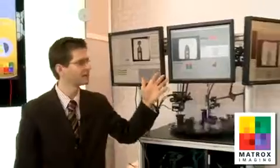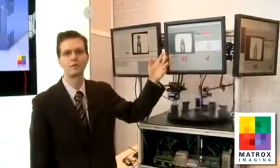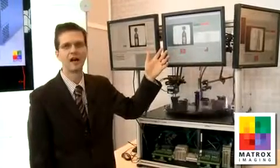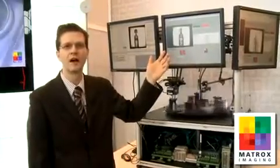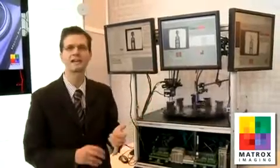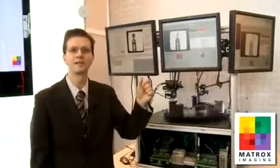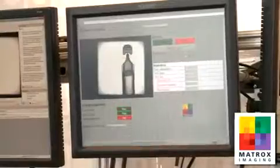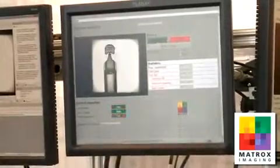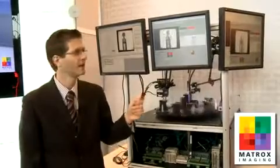Moving on to the actual running demo, we're showing ampule inspection, and specifically all the tools that can be deployed onto the Iris GT smart camera. Here we're detecting the fill level, and the alignment of the nozzle: is it straight or is it crooked? We're also looking for the presence of the cap and whether the cap is inserted correctly.